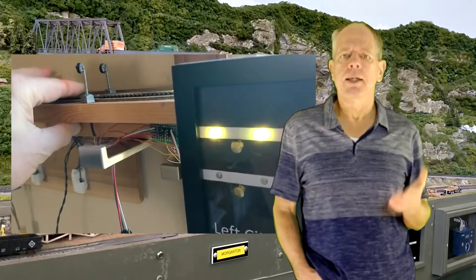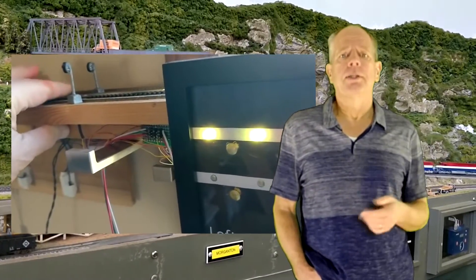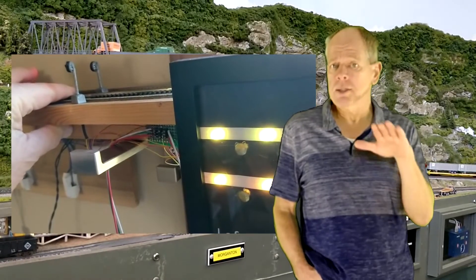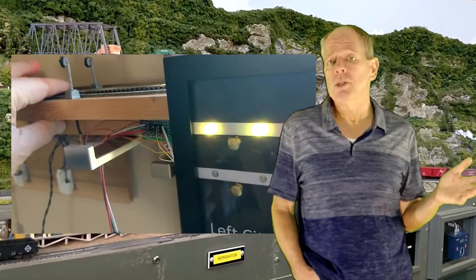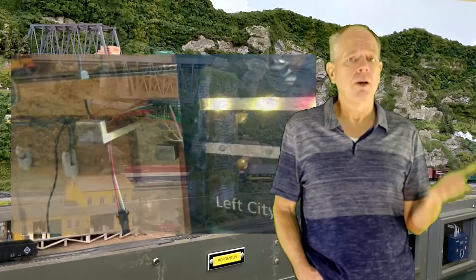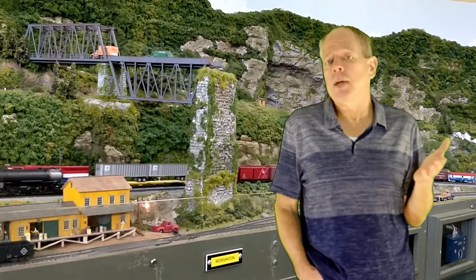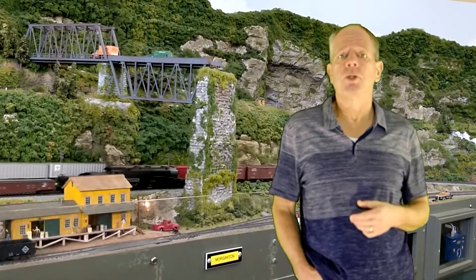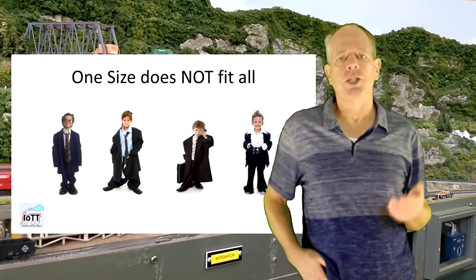This is certainly the strength of a diode-based sensor. Even very small currents — like when you bridge both rails with a finger — get reliably detected. But this may become a disadvantage when using the detector in a garden railroad where there is some moisture on the track, which may lead to false positives. So what is the better solution? Again, it depends on the application.